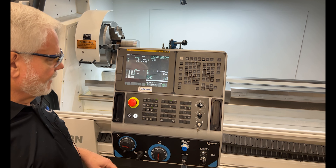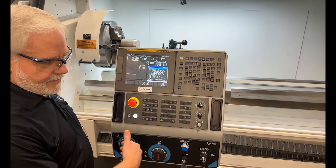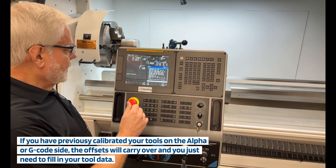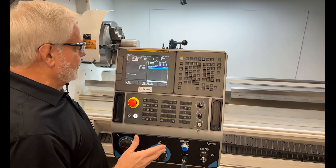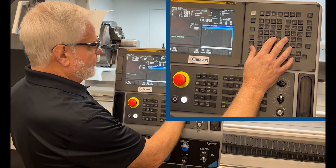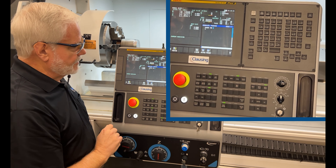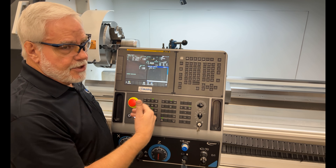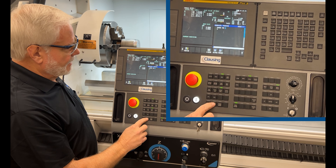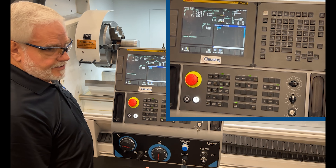One of the items we'll need to cover for the Manual Guide is setting up your tools — your tool calibration. This is on the basis you haven't set them on the alpha side nor on the G-code side; this is strictly setting your tools on the Manual Guide I. The first safe thing to do is to activate tool zero, which cancels any tool offset that has been activated. So if we type T00 in the block, EOB, insert — you'll see it's shown in the program — then hit cycle start. For demonstration purposes, I have a key in my door so I can keep it open. So I'm going to hit cycle start and it's gone to tool zero, making it safer to do the tool calibration.